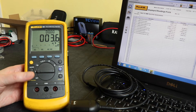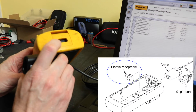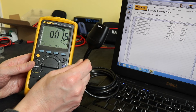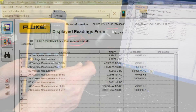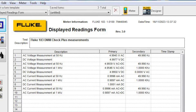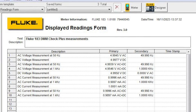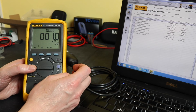The IR port on the back connects to software — this is the Fluke FlukeView Forms Basic version I have running here. You can buy the IR adapter from Fluke, and there is a little plastic insert that the adapter clips onto, though that insert isn't present. This software and adapter are actually for another instrument, but they still work. I'll put a screenshot of the real measurements on screen — in 5,000 count mode it looks like there's an extra digit on the PC that we don't have on the screen. The 183 has 10 memory slots versus 30 on the 185 — another difference between the two.